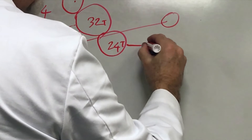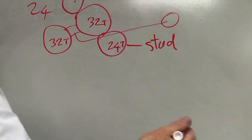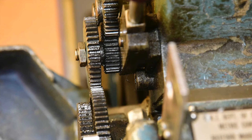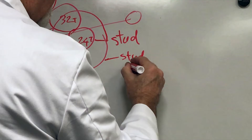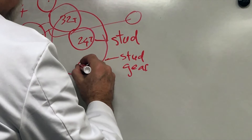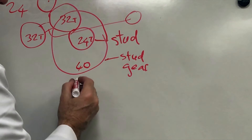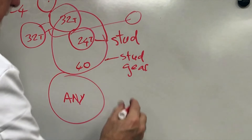The RPM at the stud gear is the same as the RPM of the spindle. The stud gear is a compound gear, meaning two gears bolted or keyed together — you can change the outer wheel. You can vary the number of teeth on the stud gear and it will have an effect, because a small gear driving a bigger wheel changes the ratio. Say we put a 40-tooth gear on the stud, then it drives an idler wheel (which we can ignore) and then onto the lead screw gear.